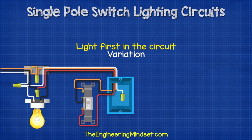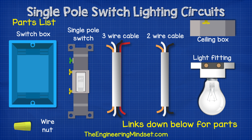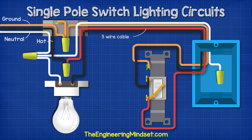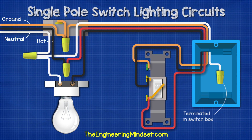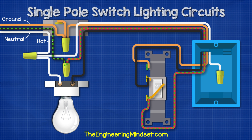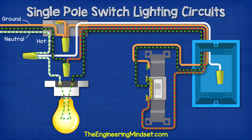The third version you might come across uses a three-wire cable between the ceiling box and the switch. It's otherwise nearly identical to the previous version, except that we use the red and black wires to carry electricity to the switch, rather than wrapping black electrical tape around the white wire. In this design, we do need to use more wire nuts, and one of the neutral wires will terminate within the switch box. This version otherwise works the same — when we power the circuit, electricity flows through the switch but it can't pass across because the switch is broken. When we flip the switch, it will complete the circuit and power the light until we again flip the switch off.